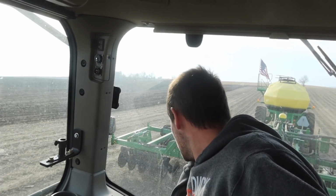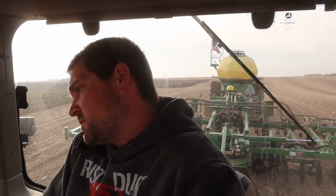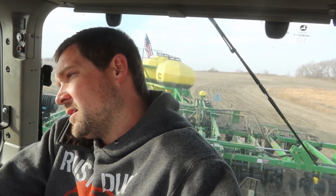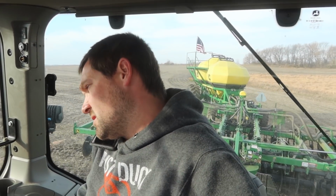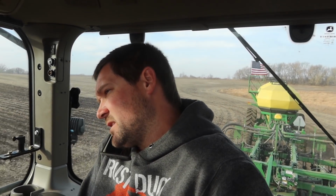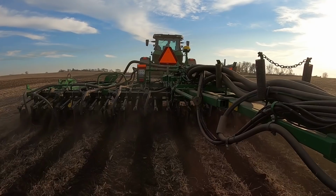Yeah, it went all day on that the other day now. So I don't know. I mean, I haven't changed anything other than that. If it was the speed sensors, why is it still giving me speeds and it's inconsistent? You know, it was really high, now it's low, and the front one was correct, now it's high. I mean, what are the odds that they both go bad and read differently like that? Well, that's what's so frustrating here, is the whole thing should be so simple, and it's just been constant problems, and there's just not that much to it.